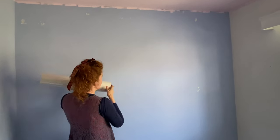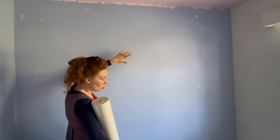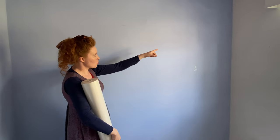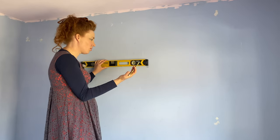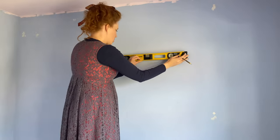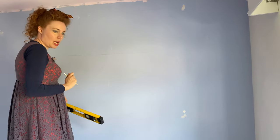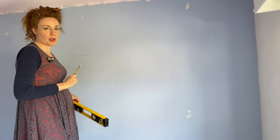I'm going to do my first piece of wallpaper. I'm going to draw a line with the spirit level — it doesn't have to be that accurate — along here. My first piece of wallpaper is going to go in the middle of the wall, and then I'm going to paper outwards; my last one I'll need to trim at the top. I'm going to cut my wallpaper to the width of this wall with a little bit extra so we can trim. I've got my mark and my spirit level — I'm going to draw a rough guide line for where I'll put my first piece of paper. Then I'll measure the width of this wall, add about 20 centimetres, and that's going to be the length of the piece I cut.